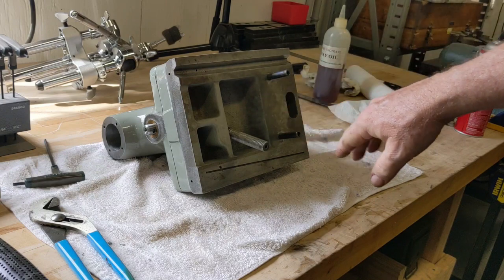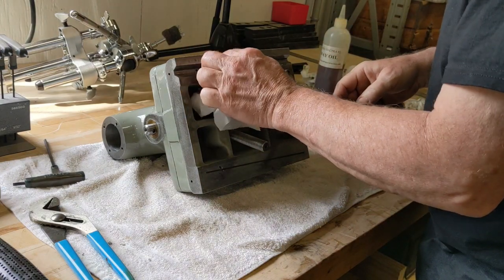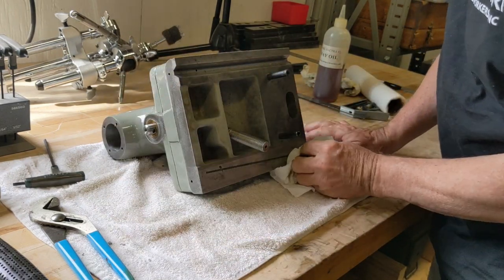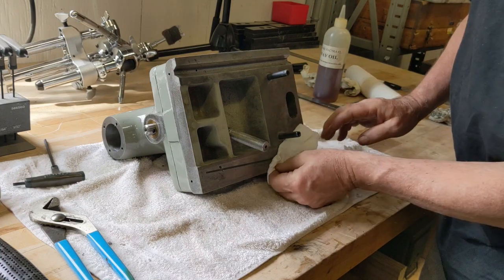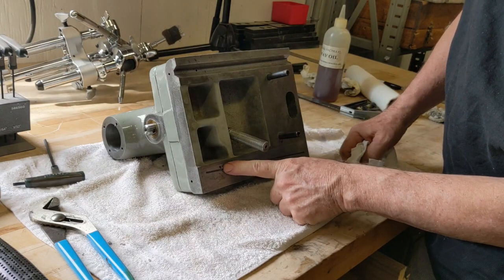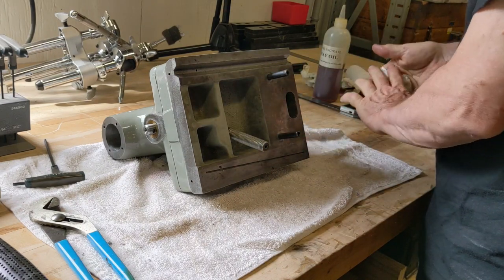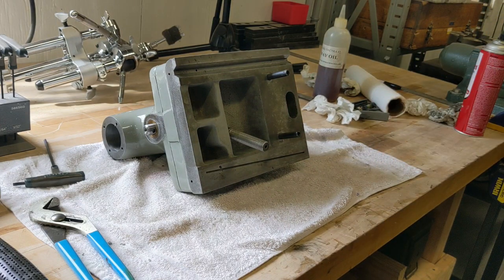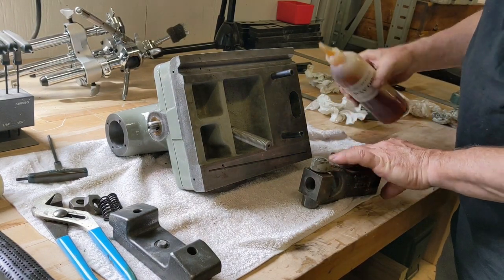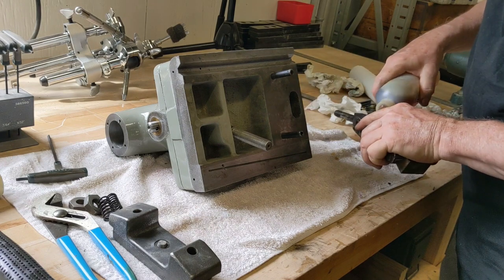So the next thing that we'll do is we'll assemble the clamping device mechanism. I mean, looking at these, I can still see the scraping marks on these ways. They don't look terrible, but we'll find out. I didn't measure this before I took the lathe apart. Talked before, there's an oil passage there, lines up with this groove, and then obviously an oil passage there. All right, let's get the rest of those parts and we'll get this next piece assembled. All right, get this part right here. Get a little bit of oil on that. We'll get a little bit of oil here and here.